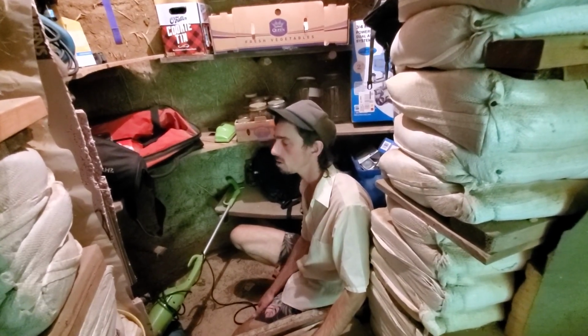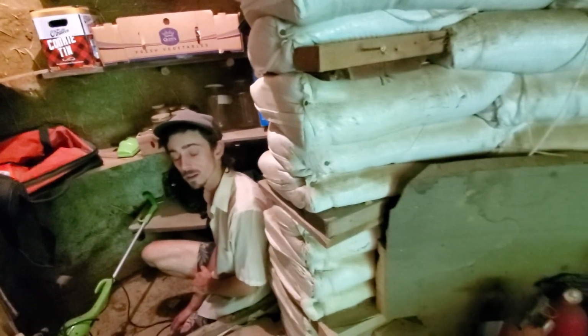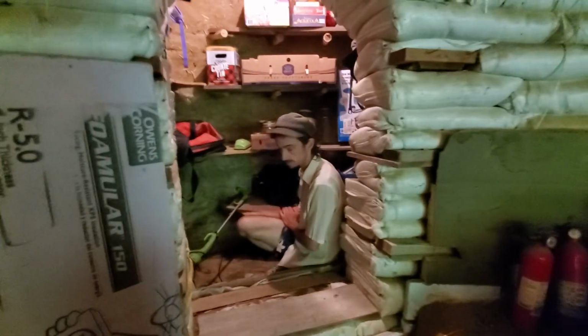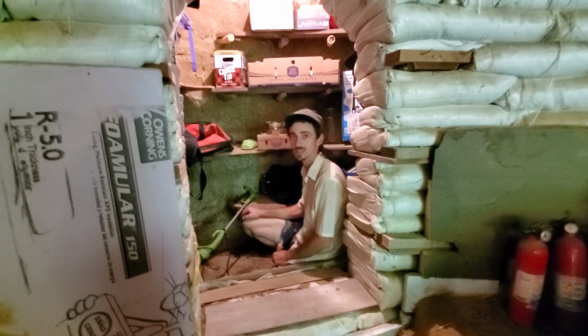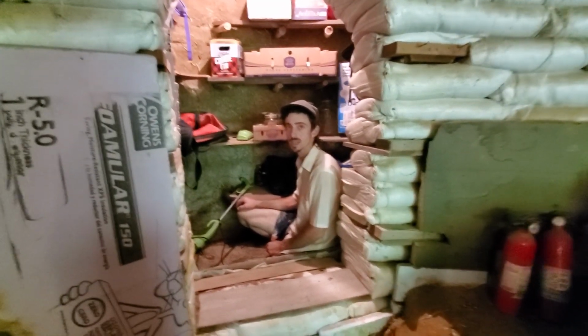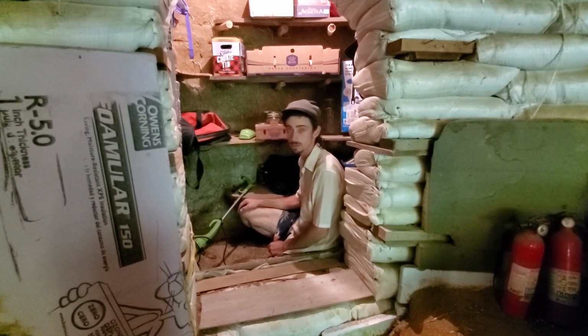And when you use linseed oil, different people have different thoughts on boiled versus raw. Raw takes forever, and boiled isn't even boiled anymore. It's all the chemical additives, like heavy metal additives. You can't actually buy boiled that I know of. So with those things in mind, do you use either one based on the application?